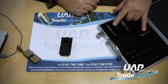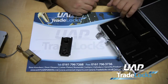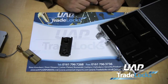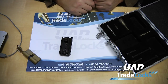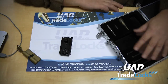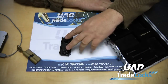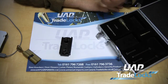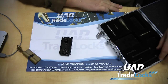Within the kit we provide various drivers. These two drivers — both long and short — are designed to help put the pull screws into the cylinder, and we have an extension piece in case you have to overcome a handle or something awkward that's obstructing you. We also have four bolts for the thrust plate: two long bolts and two short bolts, depending on the job you're trying to do.